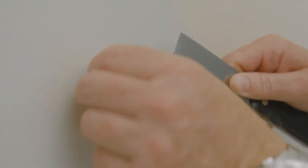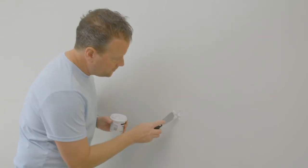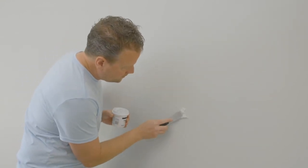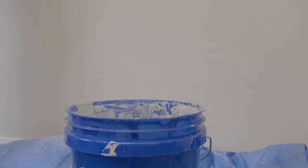If you find that you have gouges in your ceiling or walls, take the following steps to resolve the issue. First, remove all loose pieces, then fill the gouge with spackling paste and apply with a clean putty knife. Make sure to level the paste off to the surface of the panel. Finally, once the compound is dry, touch up the areas with paint.